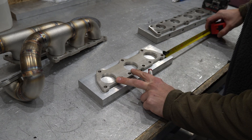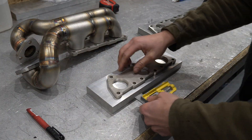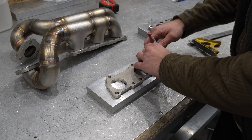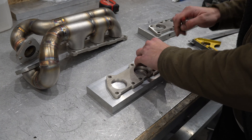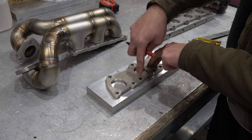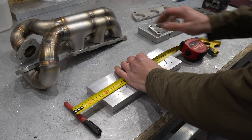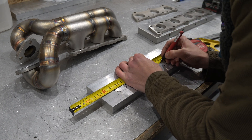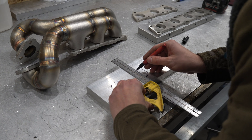All you need — it doesn't need to be perfect. Just grab the flange you're going to be using, center it up a little bit, get it somewhere in the middle. I'm going to get a square and set it just from the bottom, just to make it look nice and even. For the holes, I'll just mark a couple of them because I'll use a center punch — mark that one, drill that.